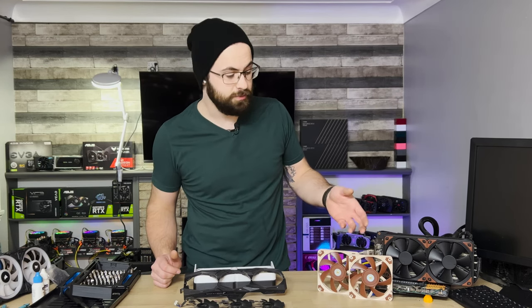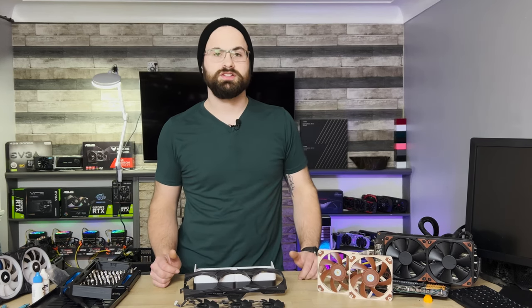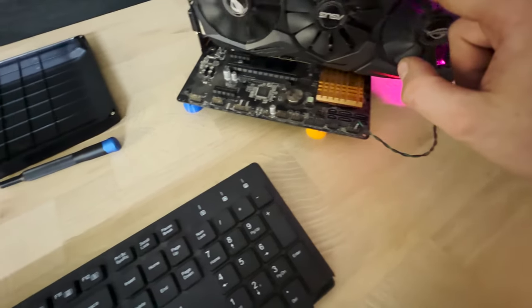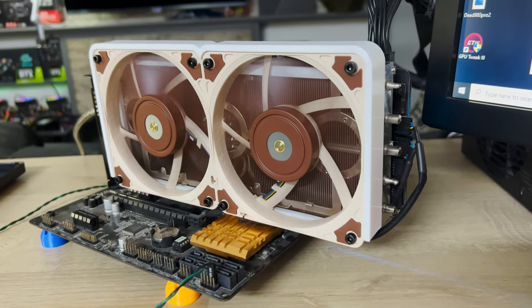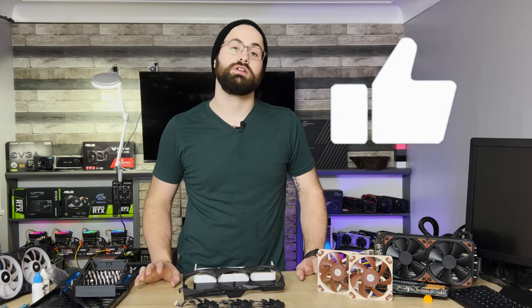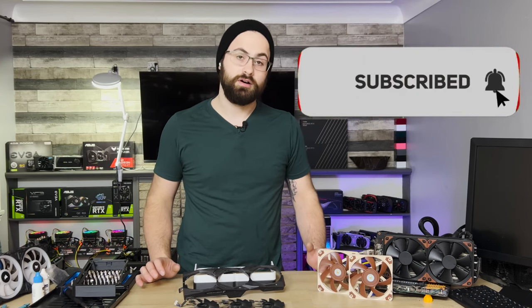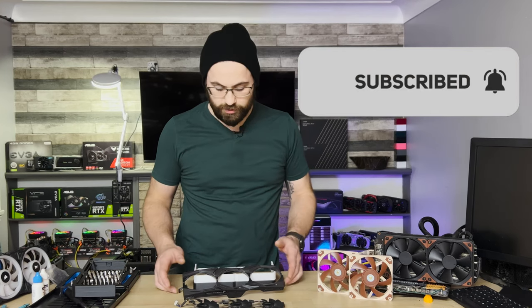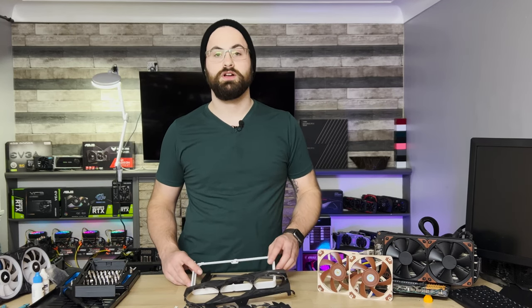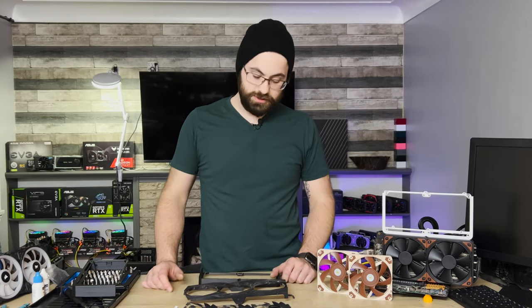So, a summary: using larger fans allows us to move more air at lower RPMs, resulting in less noise, and depending on the fan type, anywhere from the same cooling to slightly better cooling. The RX 580 isn't a very power hungry card — to see larger differences between the stock three-fan shroud versus my dual 120 mil shroud, you'd want a higher thermal load like a 1080 Ti or 2080 Ti. If you thought this was cool, drop me a like. If you're interested in more videos like this, subscribe and ring the bell. If you have one of these older three-fan Strix cards with failing fans or just want something unique, I'll have a link below where you can check these out.